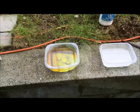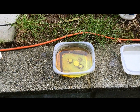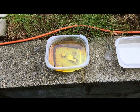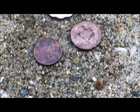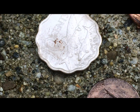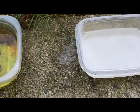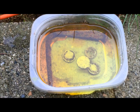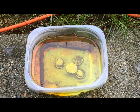I actually made it a little stronger mix. I'm using pure muriatic acid — it works really good. You just can't keep the items in there too long. You have to watch the process. As you can see, most of the coins are really clean already — they're all clean. You can do a little slight scrubbing to get the rust off. I've got the big spike in there. It's heavily corroded, full of rust, so it's going to take a little while.